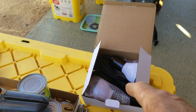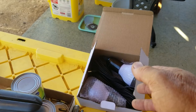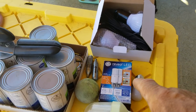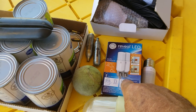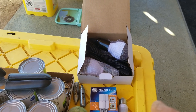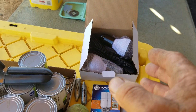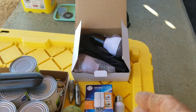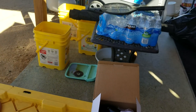The Harbor Freight panels come with a controller, four 25-watt panels, extra wires, and those bulbs. They're great — they put out a lot of light. There's nothing printed on them so I won't unscrew one to show you. Remember: not all LEDs are created equal, including GE's. GE is the only brand I've found in incandescent shapes that works with DC voltage. I haven't found any other brands that work, so if anyone tries one and it works with DC voltage, let me know and I'll pass it along.